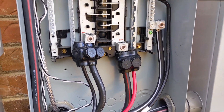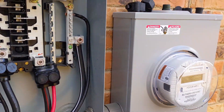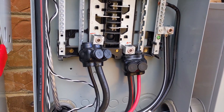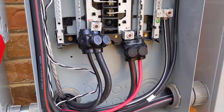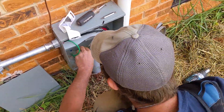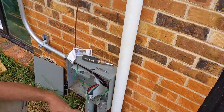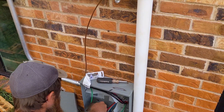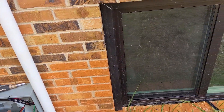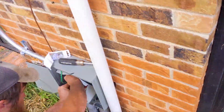The comms can take the longest time, like with most inverters. Abraham is down doing grounding, making sure all raceways and metal boxes have ground bars and everything is bonded. This is a remodel — we already have two ground rods six feet apart, so we're good there. Inspection was hoped for Monday but it's going to happen Tuesday.